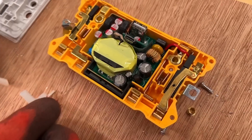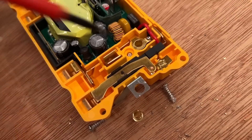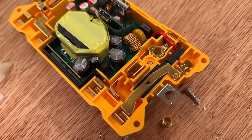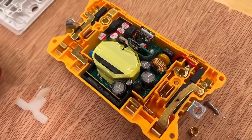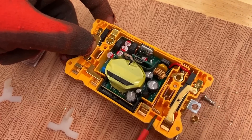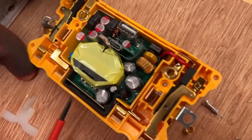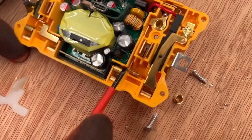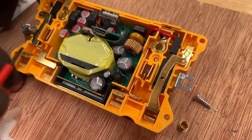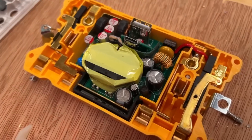So there's our shutters — we'll remove them from the socket. Here's the switch. Without the mechanism in it, you can see they're actually single pole, where normally we'd see double pole in sockets — but some things have to give, a little bit of compromise. And if we trace that back out, there you can see the neutral back up at that terminal. It leaves the socket contact, wanders down, around, up, behind the live, and into there. Good engineering — we've used every available millimetre.